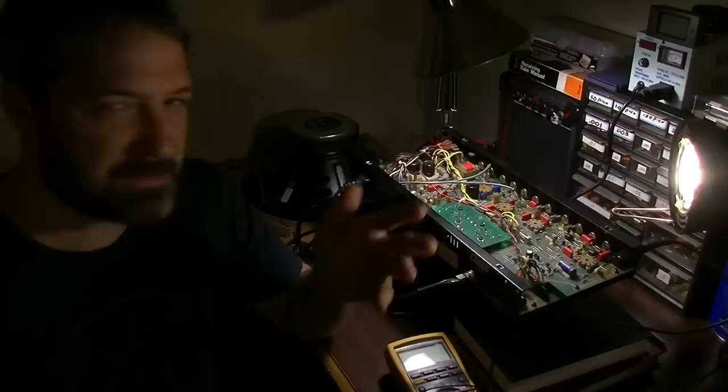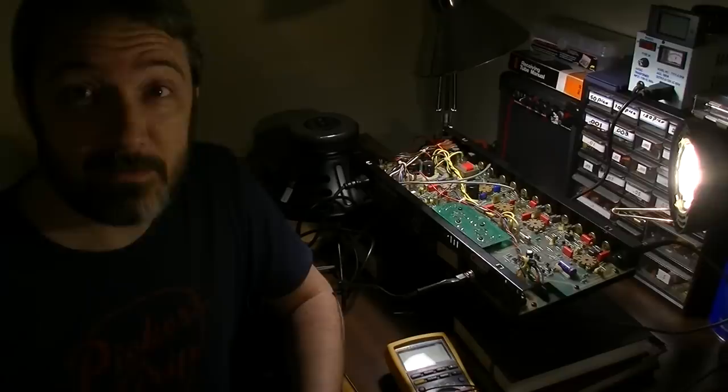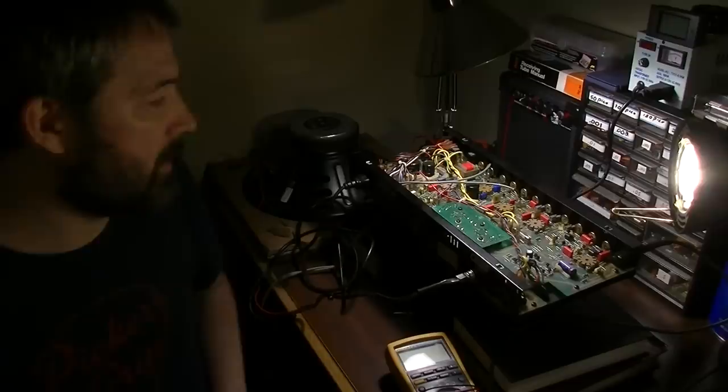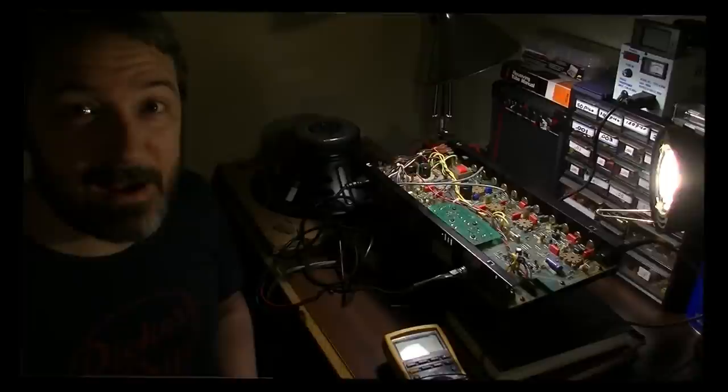I think maybe they were talking about, well, you should have changed tubes up front, and that would have solved all the problems. Well, clearly it wouldn't have in the Mesa, and clearly it also wouldn't have in this one. So there's two in a row where just popping some new tubes in is not going to solve your problem, and you're just going to fry a new set of tubes. So it's your money if you want to do that, be my guest. But sometimes you have to bust out the amp, and more times than not, it's best to just go ahead and remove the chassis at the very outset.